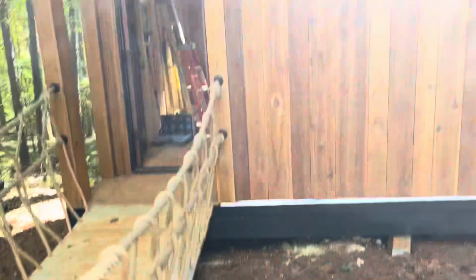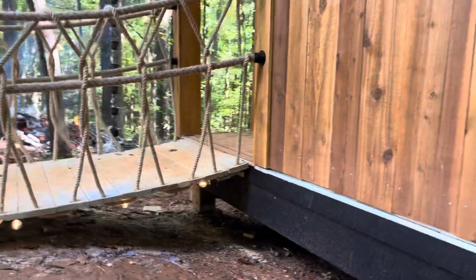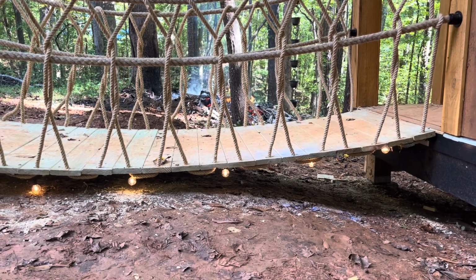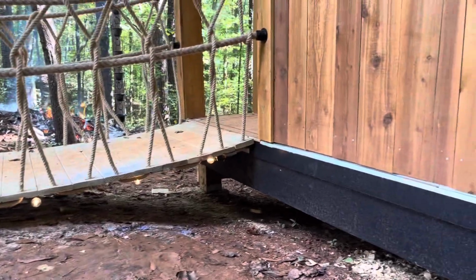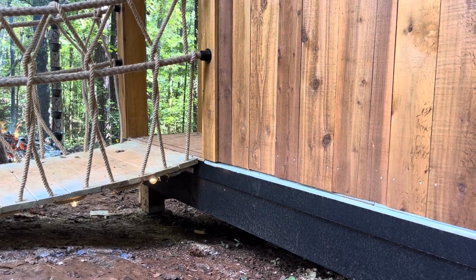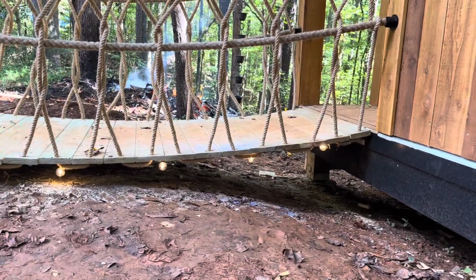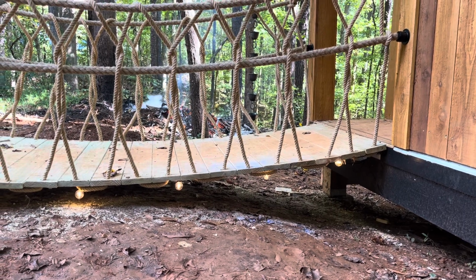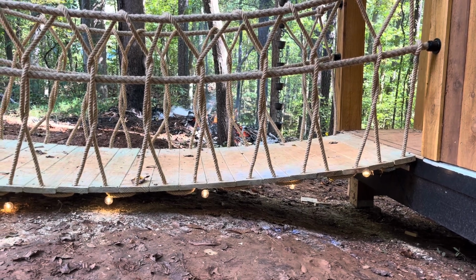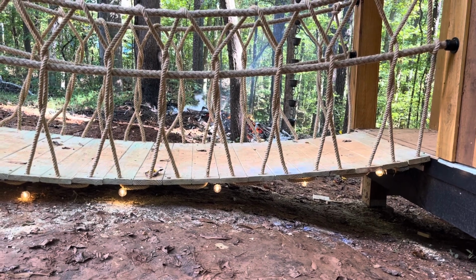I was very surprised to see that as you start to crank down on those eye bolts to get the tension I needed for the cable to have the right amount of bow and to be able to support somebody, it will pull two or three 2x12s out of position. It'll bend them. So I have to come back with a post that is used, you probably have seen them used for pushing up joists, like in a crawl space or in a garage where you have your floor joists dropping and sinking, and you put these underneath and you screw them and they will lift the joist.